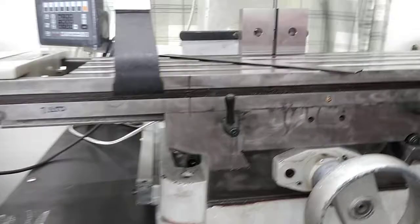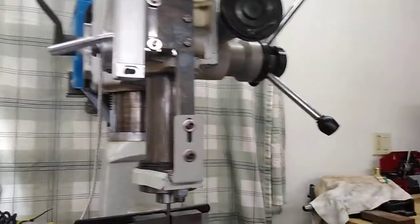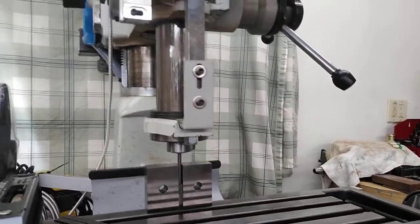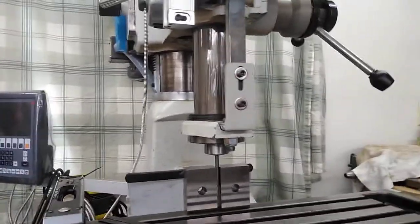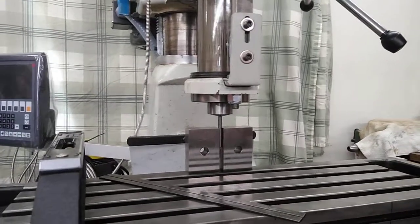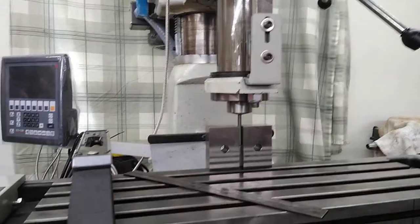This may be a little unorthodox way I tram one in, because I move this head until I get the Z-axis motor where I can take the quill up and down. Right now I'm set at my favorite height of nine inches — five for the vise and four for medium to long tools, fly cutters, etc.